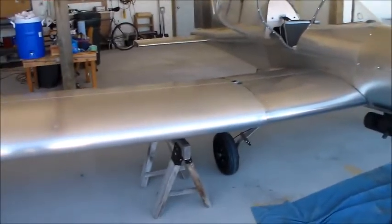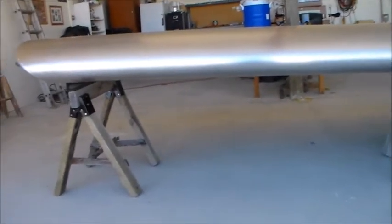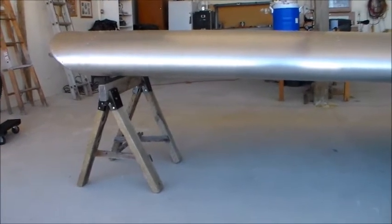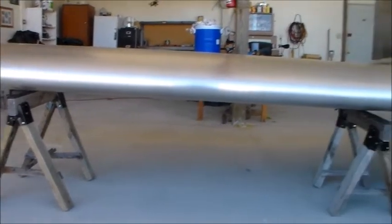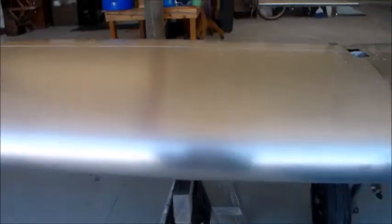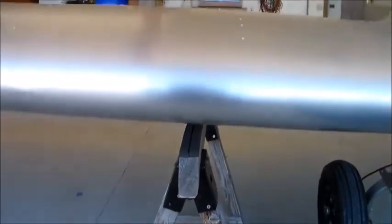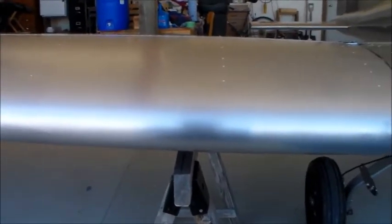For the first part I put a couple of sawhorses under the wings and they'll support the wing when I release it. I set them up so they're a couple of inches to the outside of a rib, so that when I set the wing on the sawhorses it is supported by the rib. You can see that this sawhorse is just a little bit to the left of the rivet line for that rib, so that when I move it a few inches to the left to separate it from the fuselage it'll be sitting on its strongest point, which is a rib line.